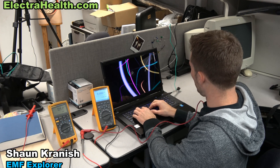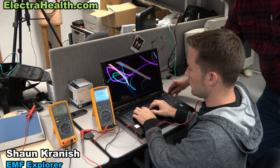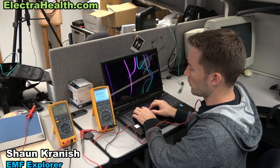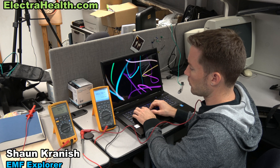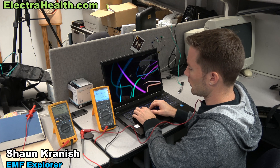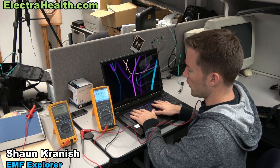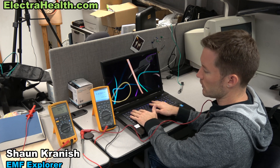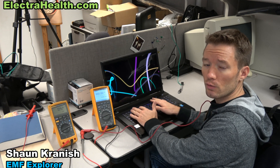If we pull that adapter back out — 3.5, up to 7.8, and now we're bouncing up to 8.0, 8.10. We're kind of all over the place. This is why when you're on a laptop, we believe it's best to have that laptop grounded if we can see this body current reduced.